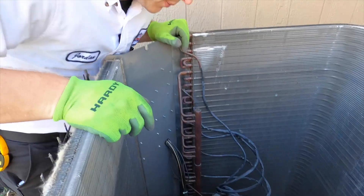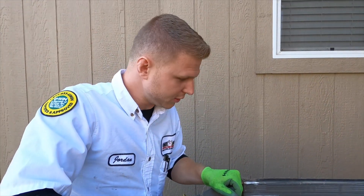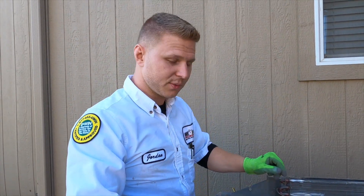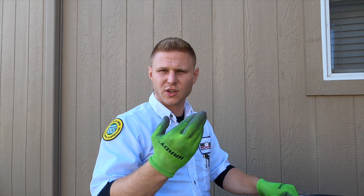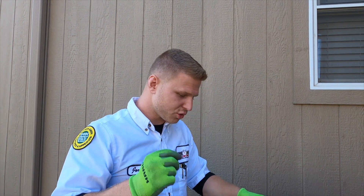I can remember the call — we had a heat pump out there and we were laying down some new mulch around the unit. I took a look inside and had three cap tubes just up against each other, crisscrossing. I reached in there and separated them. Those cap tubes get vibrating and they're so thin, they just rub together and they'll rub a hole in both sides.